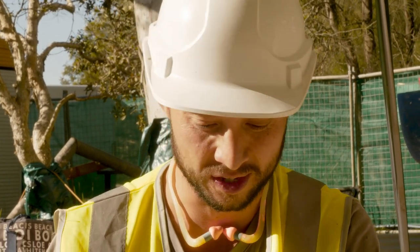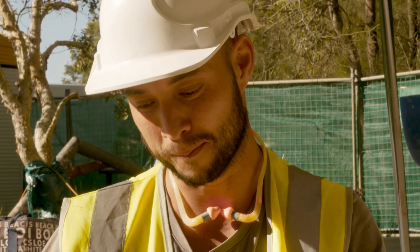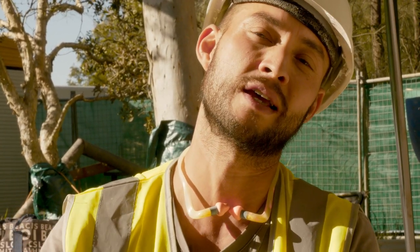Within a week it gets harder. After three or four weeks, it's quite hard. And then after three months, it's pretty hard, and it cures over time. So after a year, your wall is way stronger. Contrary to cement, which after 50 years starts to dust and become more brittle, the whole lime-hemp compound just keeps absorbing more CO2 out of the atmosphere and gets harder and harder. So your building potentially after 50 years gets stronger and stronger, while absorbing more CO2 out of the atmosphere and becoming more and more carbon negative.